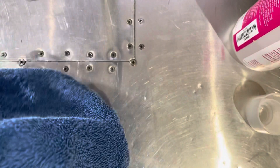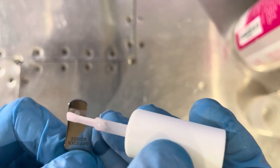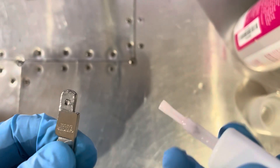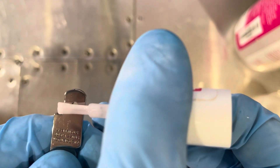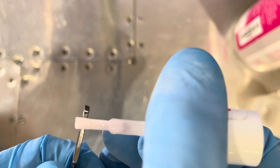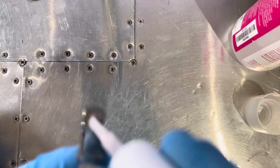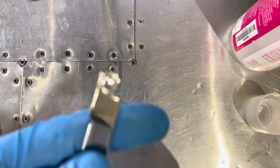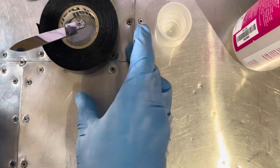Then we're also going to clean the pivot. You want to dry the pivot afterwards because we're now going to put nail polish on it. It's better if you use a bright colour, but I only had this on hand. You're going to want to paint over the moving sections of the knife. You can also paint the knife blade itself if you want to put a cool effect on it — I've seen people paint fire streaks or their initials onto blades this way. Basically, all moving parts you want to cover. Make sure you get some into the hole there so that the centre doesn't etch. While that dries, we're going to get to work making our acid solution.